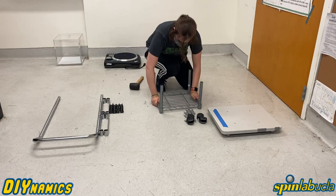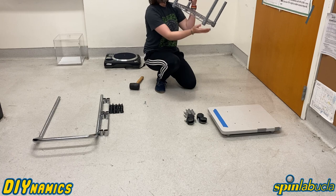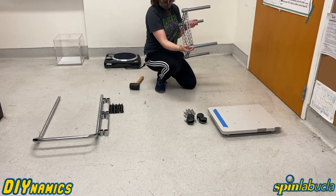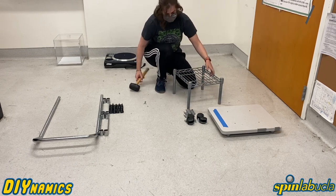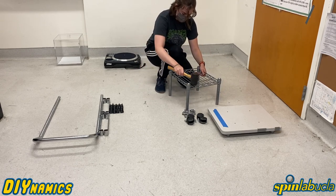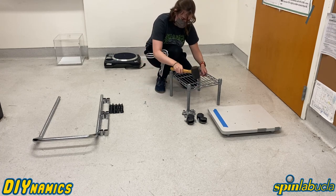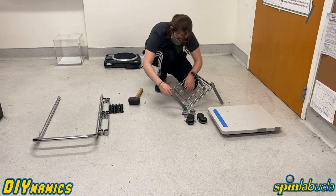Nice and firm. So you should essentially see a little bit of the gray from that plastic locking mechanism still on. If you see that more of the gray is on than the other ones, what's happened is that your piece has slipped. It's not the end of the world. Mallet on the other side, loosen it. Make sure your pieces are back to being locked. Try again.